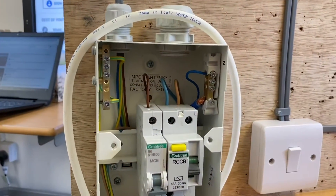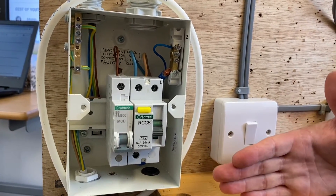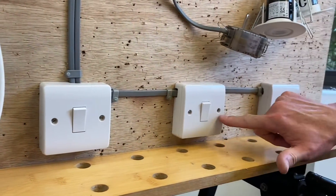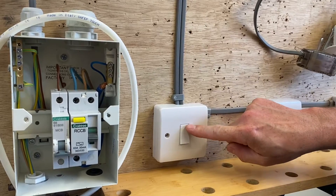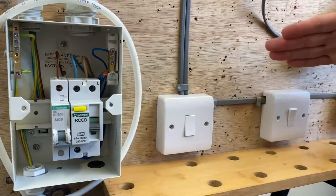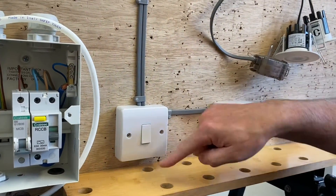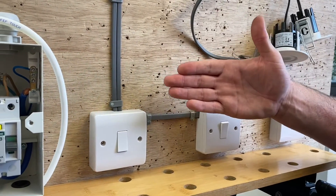For AM2, AM2S, and AM2E, with two-way or two-way and intermediate switching, you need to operate your switches according to Guidance Note 3. We don't know whether our circuit was on or off, so you test at the board, then walk out and operate a switch, come back and do all three tests again. This ensures all elements of the switching and strappers were at some point in circuit during insulation resistance testing.